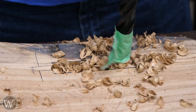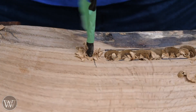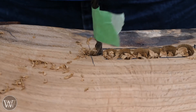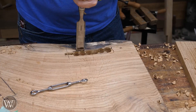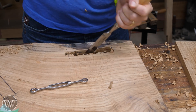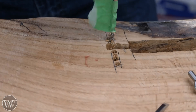We're going to auger out as much as we possibly can and then come in and chisel out the rest. For most of it I'm using a one-inch auger, but then in the section where the eye of the turnbuckle comes in I was using about a three-eighths auger bit. Once all of these are done you can blow out the chips — this makes it really easy to come in with a larger chisel and remove the waste. I'm just cleaning them out and getting to the point where the turnbuckle can fit down in there; I'm not going to be flattening out the bottom with a router.